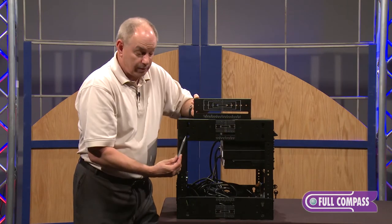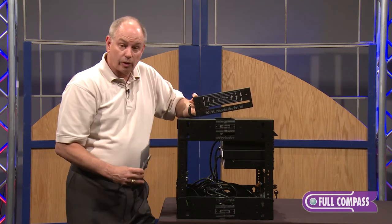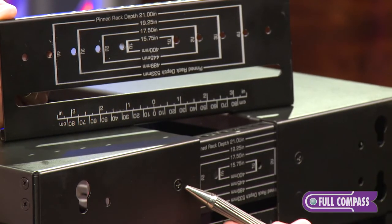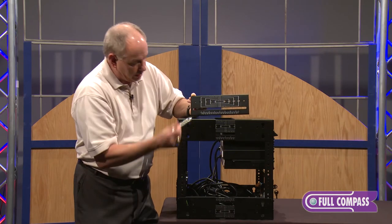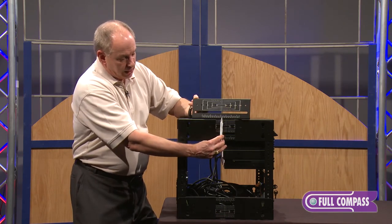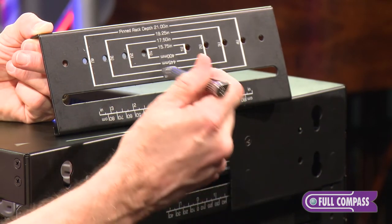To adjust the VeriRack from front to back, there are two approaches. This unit has two 7-inch sections, so when closed it's 14 inches — that's how it ships, with a top, bottom, and a separate rail kit box with all mounting hardware. For a minor adjustment, you pull out a pinning screw. In the slide there are quarter-twenty bolts, washer, nut, and washer. You loosen those up and move it back. There's a variable scale centered on zero in both inches and millimeters. To turn 14 inches into 15 and a half, simply go back one and a half inches and cinch down the variable nut.